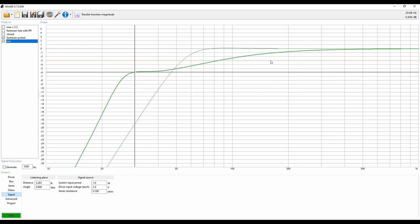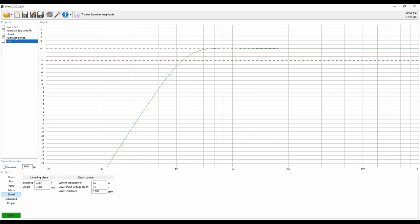It's hard to say without putting it in there. Worst case scenario is you can EQ this down, but that does mean it's going to be about 6 dB less than this one if you EQ everything flat. So that's what you want to think about when designing this. One subwoofer I designed with an extended bass shelf at negative 3 dB was the subwoofer end table, and that's because I used a PA subwoofer. A PA subwoofer really doesn't get down low, and in order to get down low, you have to do an extended bass shelf.